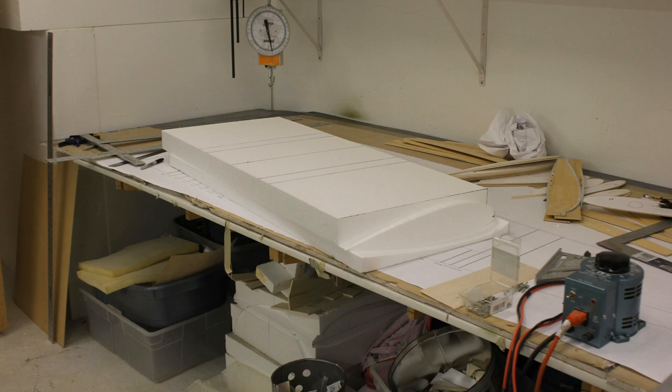This power supply is an AC power supply. If you touch that wire and you're grounded when you're cutting, it could potentially kill you. Make sure you use a DC system. I'm using an AC system because it's a Frankenstein system I designed myself — paid eight bucks at a garage sale — but don't do what I'm doing because you could shock yourself.